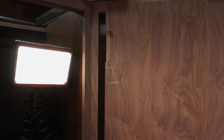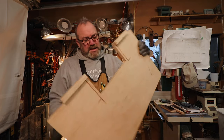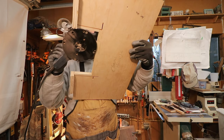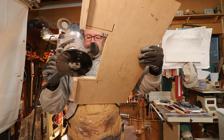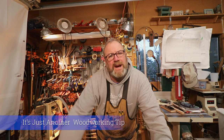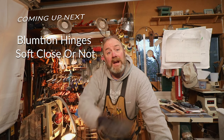Hey — it's the wrong door! I made the door too short. No wait, this door goes on another cabinet. Anyway, here's the jig — piece of plywood, got the little bumpers on there, goes up against the door, center line. All you do is the router goes in, goes out — boom. You just climb feed slowly but surely until you're all the way to the back, then that last pass you go in, out, and over. There's your little splinter of wisdom. Easy jig, simple to do. See you next time from Humble Craftworks — this is Kevin signing off, hasta mañana!